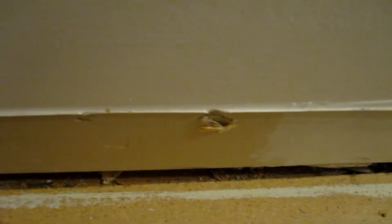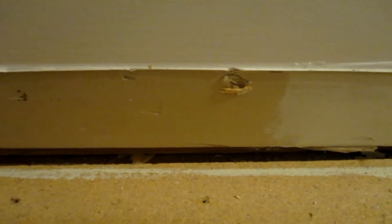I pulled off a piece of molding to try to show you what's going on here. You never know what you're going to get in an old house — this house was built in the early 70s. It almost looks like we have a subfloor over a subfloor. But in any event, if you look back there, there is the bottom plate for this closet wall. What I think is happening is the subfloor underneath is kind of going up and down a little bit, so if I put a shim under there, that should solve the problem.